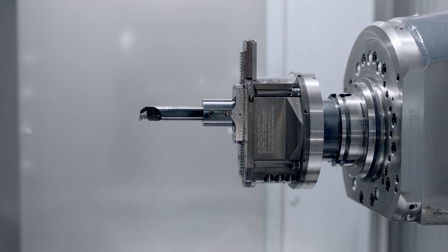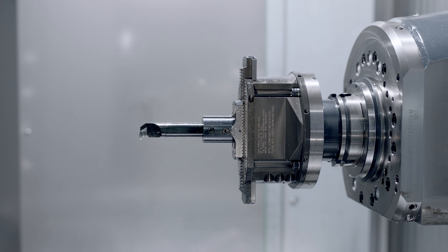This is very flexible. You have a spindle within the spindle which rotates, driving a gear that leads a tool in a linear movement. With that we are able to do chamfers, radii, whatever — any turning operation on a horizontal machine tool. And we can do this with the Siemens cycles, so it's quite easy to program, with good roundness, good accuracy, and a good surface finish.